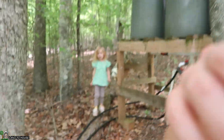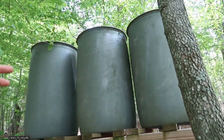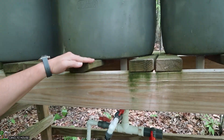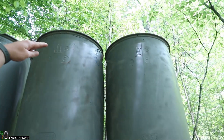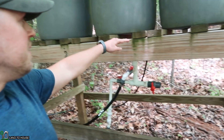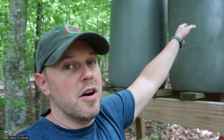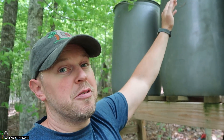I was asked why I fill from the bottom. One of the reasons is I just wanted to show people that it could be done, but the other reason is because it's faster. If you are lifting water all the way to the top, it has to fill from the top all the time. So let's say this right here is 30 feet above the creek, and that right there is 33 feet above the creek. So if the pipe is at the bottom, it's only having to lift 30 feet, and then 31, 32, and 33 as it raises the water up into these tanks. But if your pipe is going to the top from the very beginning, it always has that extra three feet that it has to push water up and fall into the tanks.